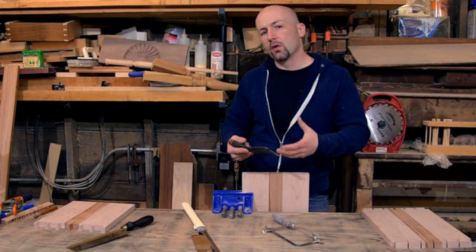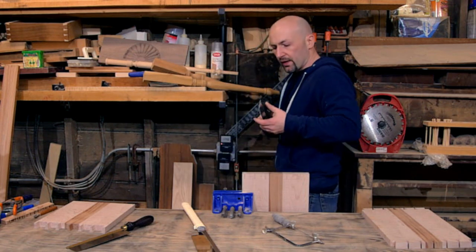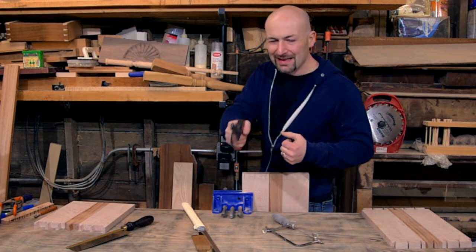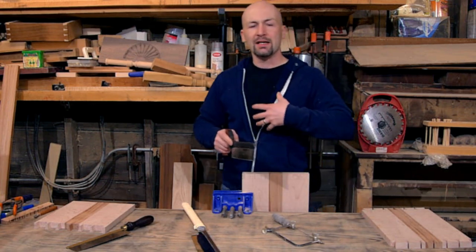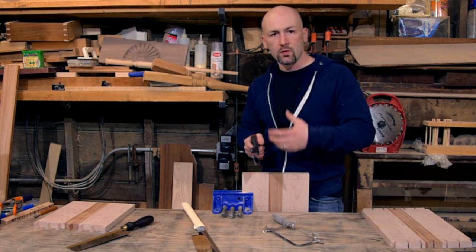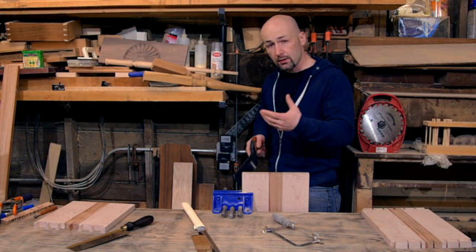I've hit the marking gauge scribe here, so I'm going to go to the other side and even that out. You can hear the nice even flow of that cut — I'm really not struggling at any point. One thing I do is, as I make my forward cut, I'm leaning into it almost like the way a boxer leans into a punch. You're going to get your body weight behind it, and it just makes the cuts go smoother. You can cut a lot of them without tiring. I'm going to go ahead and cut a couple more, and then I'll show you another saw.